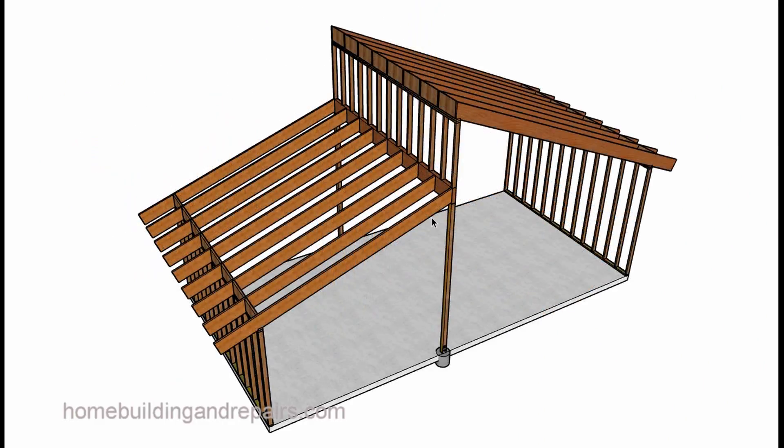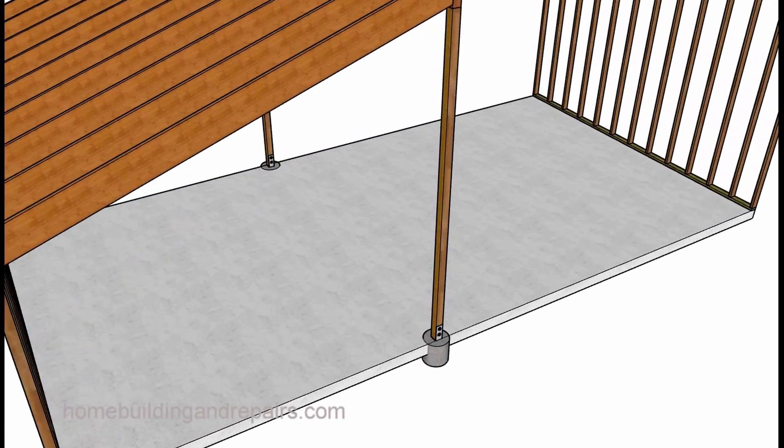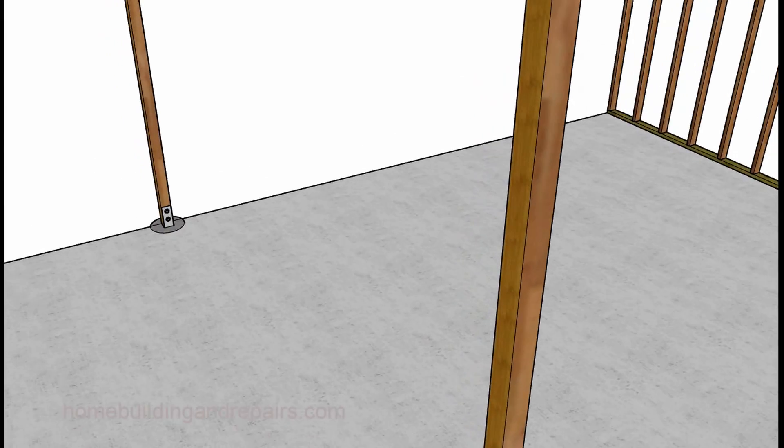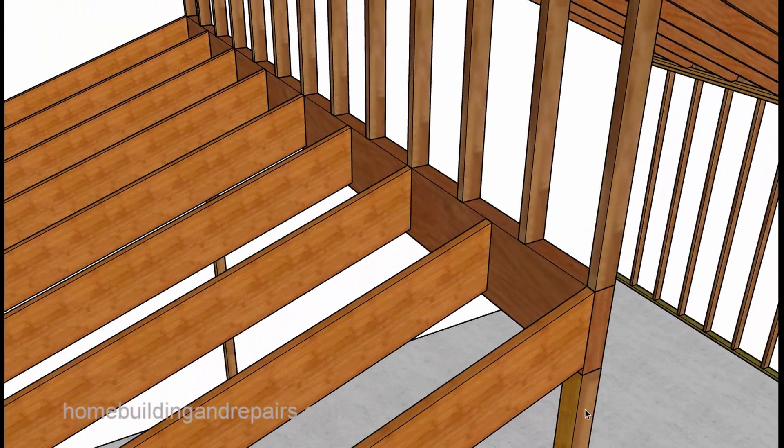A block like this for the engineer to keep him happy, and a block like the one on the other side to finish it and give it a nice look. The second design here is I removed the wall and put a post and a beam in here to support this. You would need some type of footing — I have a round footing here, though you could always have a square or rectangular shaped footing. The post will support the beam, the beam will support the wall, and the wall will support the rafters on the upper area.